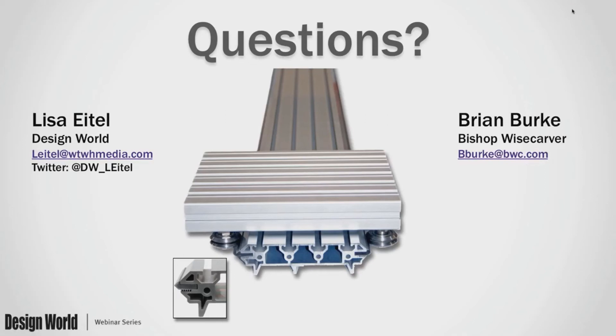Our first question: how accurate are these linear guides? Extrusions are subject to warp and twist, and there are industry standard guidelines for these values based on the size and cross-section of the extrusion. Typically, a few thousandths of an inch per foot are possible. When precision is required, secondary machining to achieve around two thousandths of an inch may be required along the entire profile. The end accuracy is specified by the application, and we can take additional actions on the extrusions to ensure we meet your precision requirements.